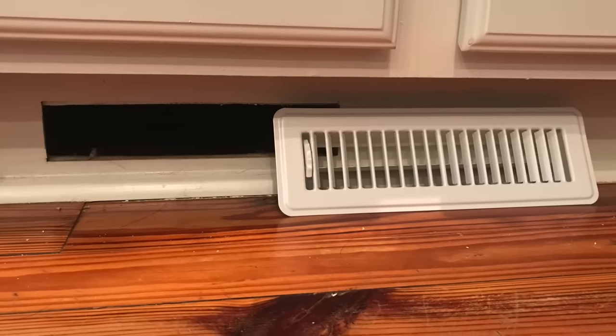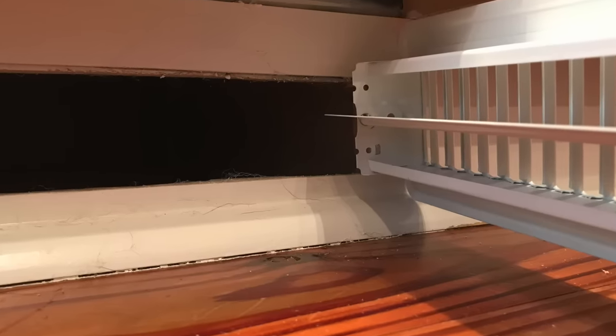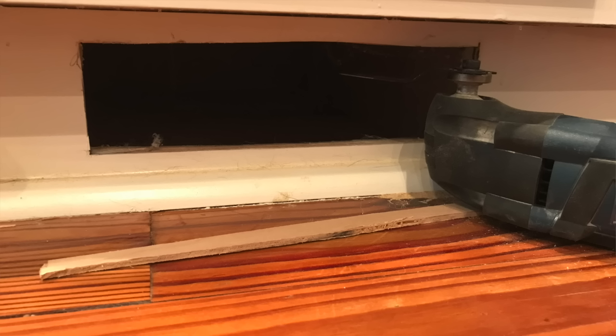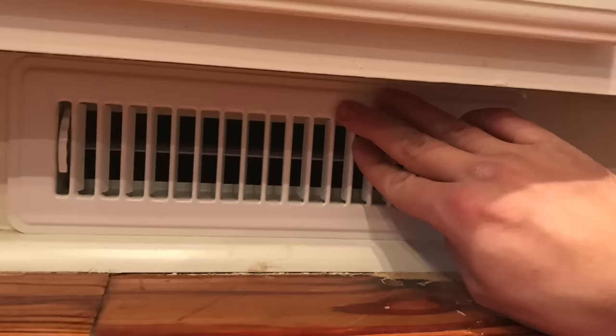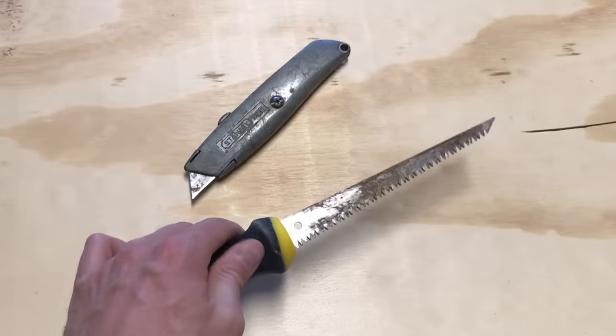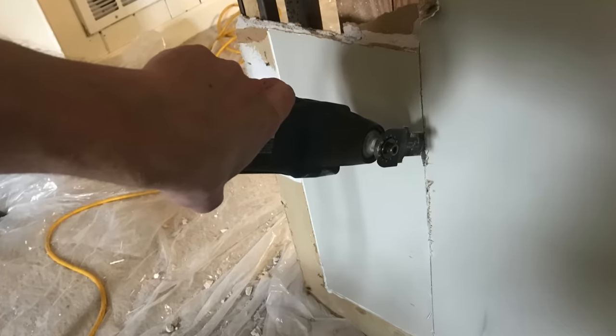You can use this method for like a thousand different scenarios. I had a client who wanted to install a new air register cover in a cabinet base, but the new one was too big for the old hole. There would have been almost no way to cut this, even with a jigsaw. But I just roughly drew my cut line, then notched the new hole out with my multi-tool. Took about five minutes, and the new vent cover fit right into place. I've also used it a ton of times for notching drywall — a task I used to do with either a knife or a jab saw — but multi-tools go through drywall like it's air.